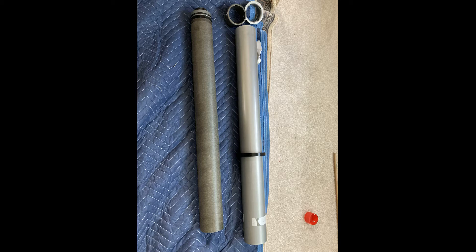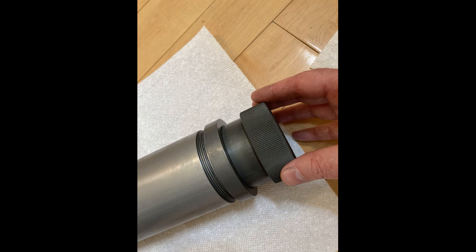Once it's nicely covered with lubricant, you take the aluminum casing — the phenolic liner is set up vertically on a hard surface — then take the aluminum casing above it and start pulling it down over the forward end. Just keep pulling it down until you get to the bottom, removing excess lubricant along the way as it spills out a little bit. Then go to the aft end of the casing, take the aft retaining ring, and start to screw it in just a little bit so that the threads start to grab. Use the CTI wrench if necessary, but don't tighten it all the way down yet — just start to tighten it so the threads are gripping.